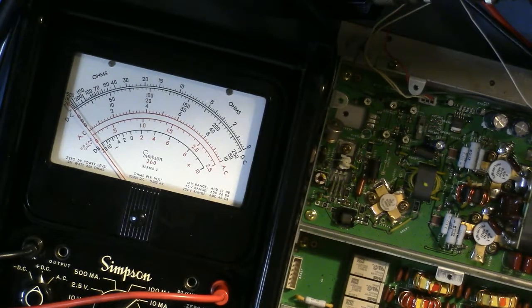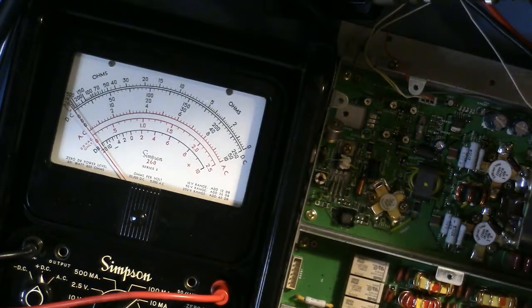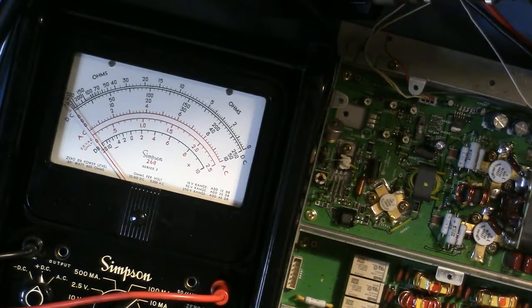I'm going to be very careful about feeling for heat at this point, because the way this is designed, my heatsink is resting on the tabletop, so it doesn't even have convection airflow from underneath. I have to get to the adjustments inside the board here, which normally would be facing down into the radio. The fan for this unit is in the radio. Not a very good situation, because 5 amps on these drains at 30 volts. I kept saying 48, but it's 30 volts. But it's still 150 watts per device. So we're going to get warm here.